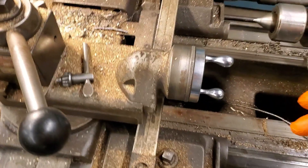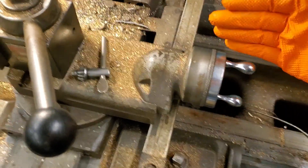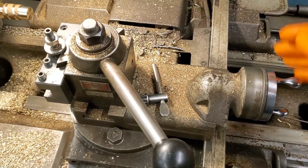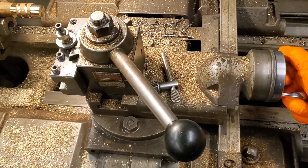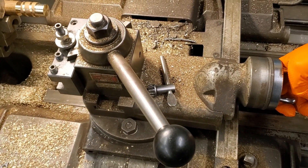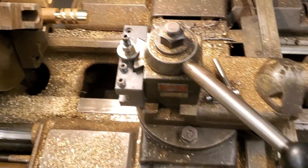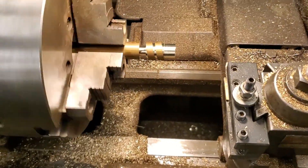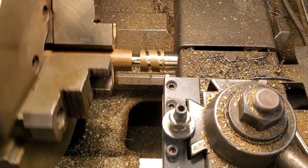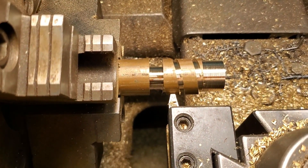My thread is looking good and I'm ready to cut the second one. I'll cut that to exactly the same depth as the first one using the cross feed, but first I need to move the tool over by the pitch of the thread using the compound. The compound is set parallel to the lathe axis, as I mentioned before, and I just need to move the tool over where it needs to go. I'd like to point out that this is only one way to cut multi-start threads, and it's a very reliable one in this case, but I'll do a video in the future on cutting multiple start threads in different ways. Before I cut the other thread, I need to verify that the second thread is going to end up in between the first one, and it looks like it will — that's pretty centered and looks quite good.